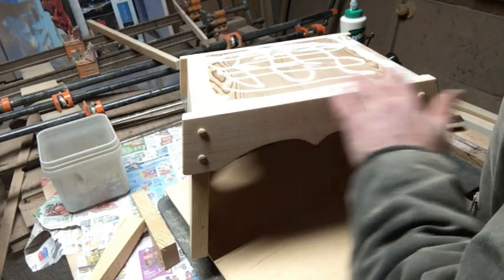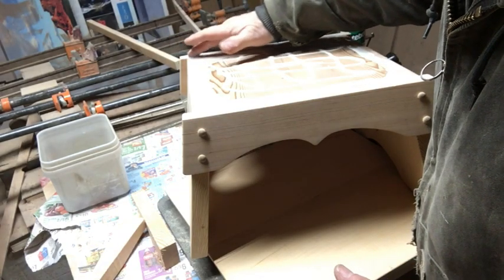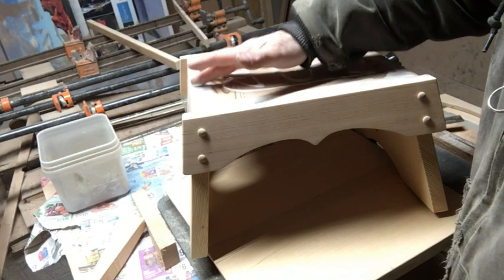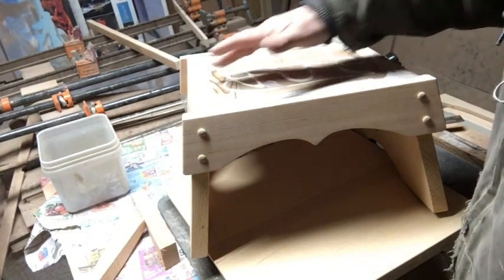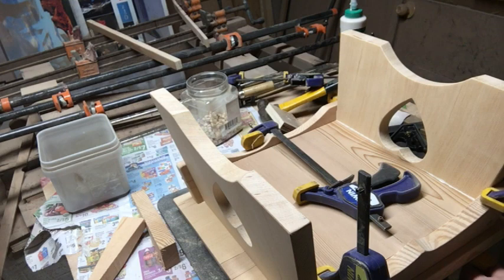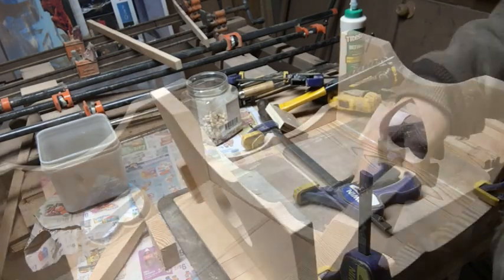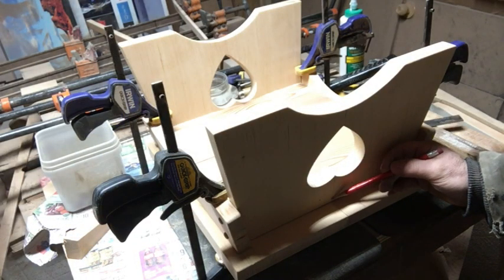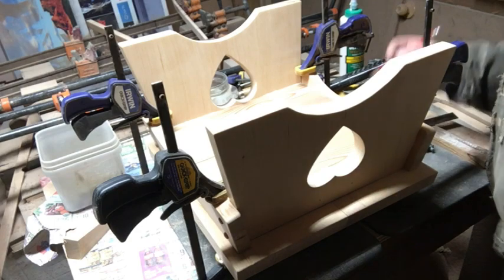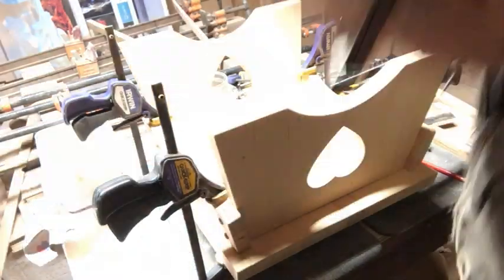I'm trying to be a little bit careful on the edges here to minimize glue squirting out the side. It's a touchy-feely thing to figure out just how much glue to put out there - enough to hold but not too much. I just take some quick clamps and put them on there lightly first because there might be some minor adjustments. Once I have all the seams and pencil marks lined up, I can make sure everything is tight and all the seams are good, then let it dry.